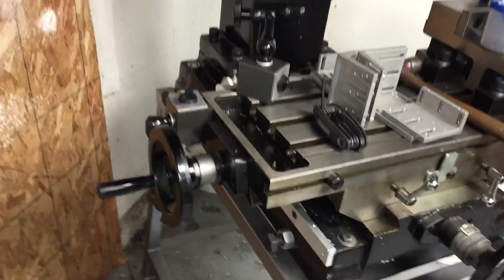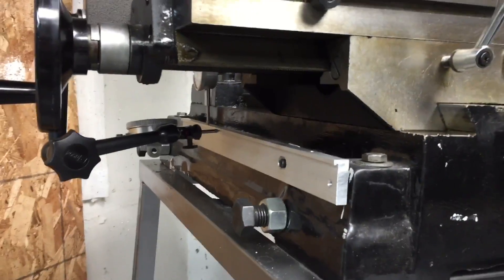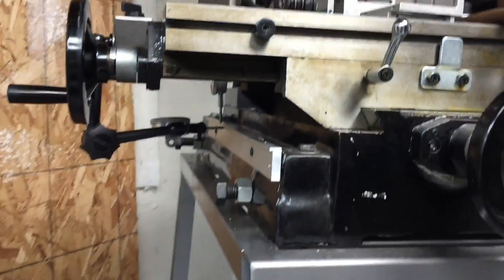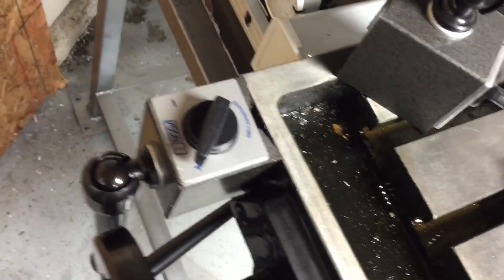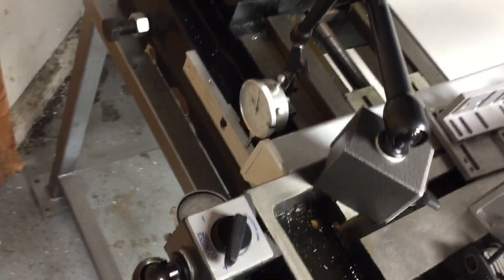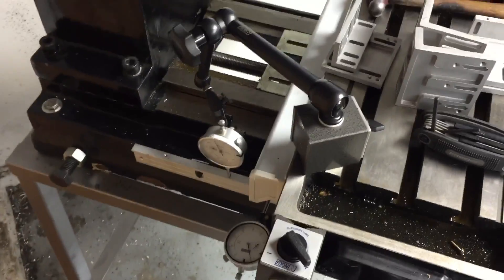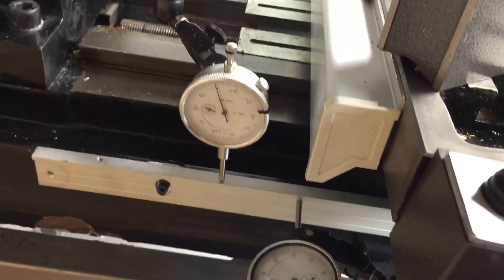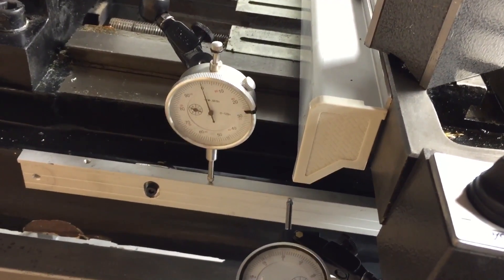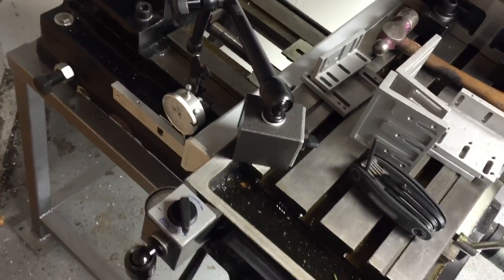Now I'm getting the Y-axis set up. I've mounted a rail for the scale. I'm using two Noga magnetic indicator bases — these allow you to have five-axis movement and they're very nice for this. I zeroed one on the axis coming in and out, and I have one on top measuring any changes in height. Using those two, that makes indicating very easy. They're very flexible.